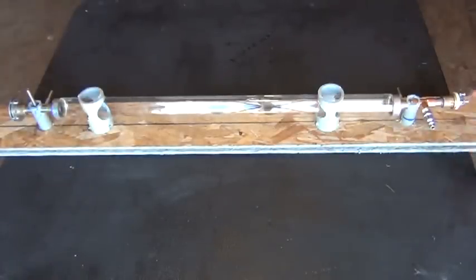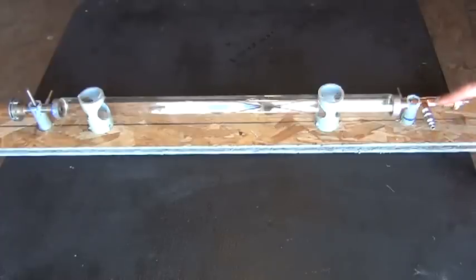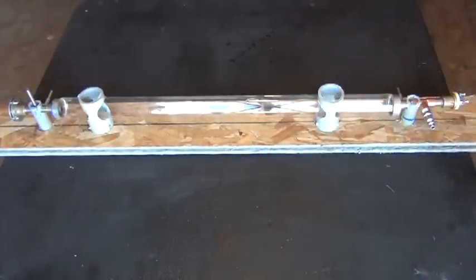All right, over here on the other side, we basically have the same exact thing, just built a little bit differently. Over here at the tip of my finger, you can see that's our other high voltage input. That's our brass input over there. So we've got our anode and our cathode set up here. We have a gas line hooked up into this copper T. Like I said, I'll pull this all apart so you can see it better. And that's going to be our actual CO2, helium mix, and a little bit of nitrogen being flooded into our tube. As it gets flooded in, the vacuum being pulled on the other side will draw the gas all the way through the reaction chamber, allowing it to interact with all the plasma charge inside of the tube. Over here at the end, we have a brass bushing, just like on the other side, which I'll show you.